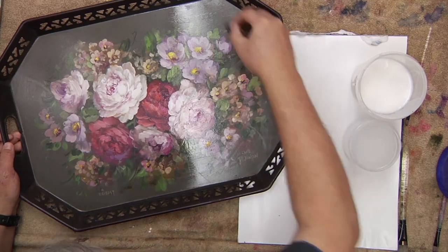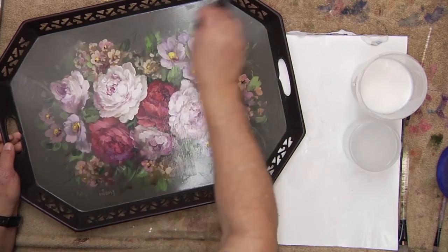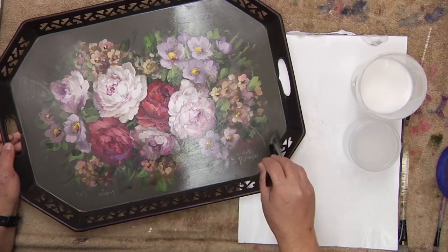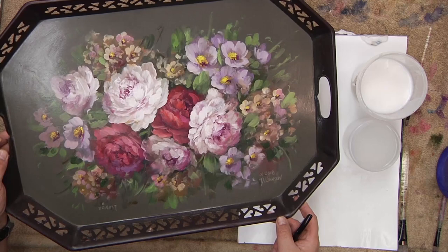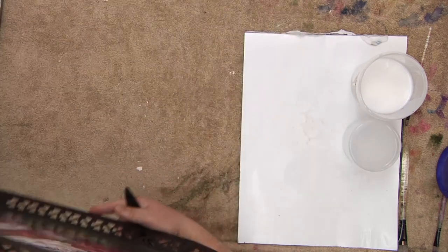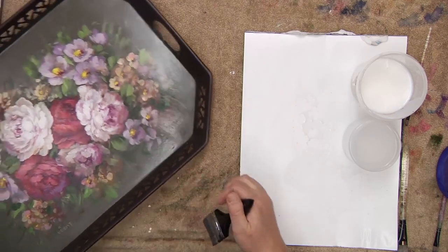If you've never varnished like this before, take a board covered with paint and try it, moving it out here and moving it around. You can see I can stroke this, lighten the pressure on your brush, lighten the pressure. I get a beautiful, beautiful coat with no brush marks. This is going to dry absolutely beautiful when it's all done. You can see how it wakes up those colors, and it'll be a beautiful piece.